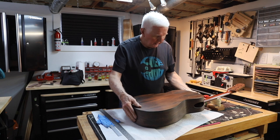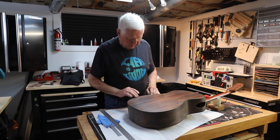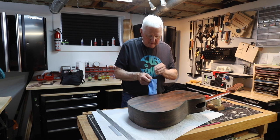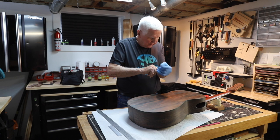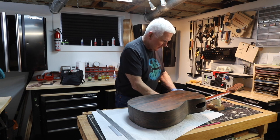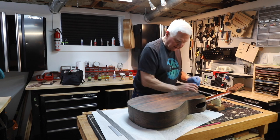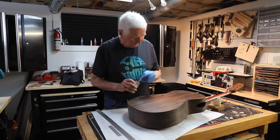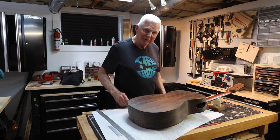So that's where we got to. What I have been doing here is putting a wash coat on — I've just started on the back. I've got some Brazilian rosewood dust — this is sawdust, it's end grain. The idea is that the end grain will fill up the pores. And so I am pore-filling. I have knocked it over — shaking hands again.